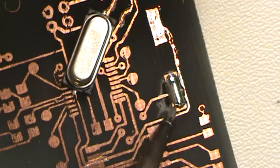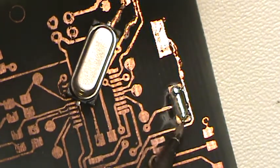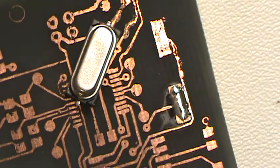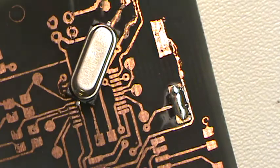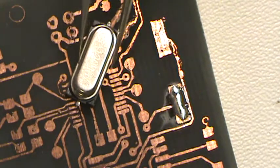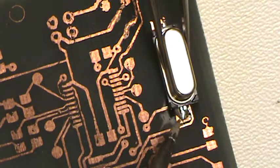Well, yeah, I think it's looking pretty good. I'm looking in the little monitor here on the camera. But see how the solder is real shiny? Yeah, it's really shiny. That's because the heat's correct on it. So you only do, at least I only do, one side. I mean, this is really a personal preference thing. But I only do one side at a time.